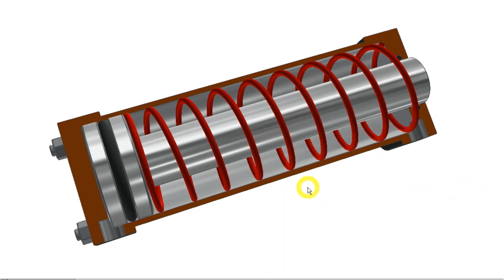If a hydraulic cylinder is sagging, it can leak oil through the directional control valve, or internal leakage can occur over the piston. In this case, oil will move from one side of the piston to the other, and the piston and rod will move accordingly.